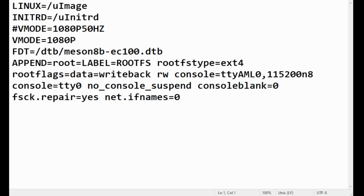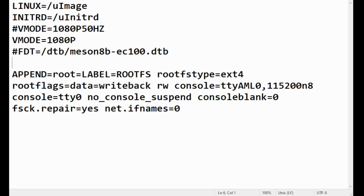And if you don't get the precise image for your hardware selection, it just won't boot. Coupled with the fact that there are device trees in some images that require you to find the correct .dtb file, then rename it, and then you've got to put it in your root folder on the SD card boot partition, and then you have to make some changes to the uenv.txt file to point to the correct device tree file. Expect the worst and hope for the best.